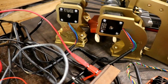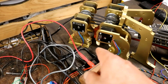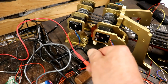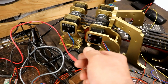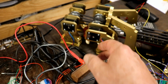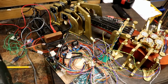That will then be controlled, and hopefully, I don't know whether it's going to work, but once it twangs, the feedback will be the pitch, so we won't need any switches or anything. If it's too low, it knows to turn the motor a little bit whichever way and then twang it again, and if it's still too low, then a bit more. It'll be interesting to see how it works. It might be it needs to go a little bit too far to start with and then slowly hone in on the actual frequency, but I'll get on with that when I have a chance.